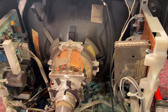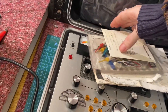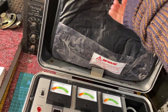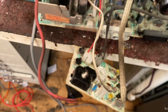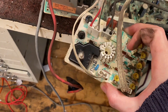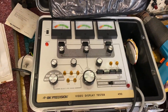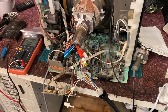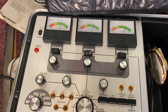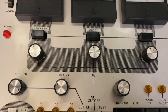That's off and we're going to take off this neck board. We come over to the CRT tester, drop this down, and pick out the one that fits the CRT. It doesn't look too burnt up in there. Let's have a look at this base — I think it's this one. It took an annoying amount of time to set up — my fault for not having the right adapter, so I've used this universal thing. There we go — tests all right, no shorts. So our tube's all right.